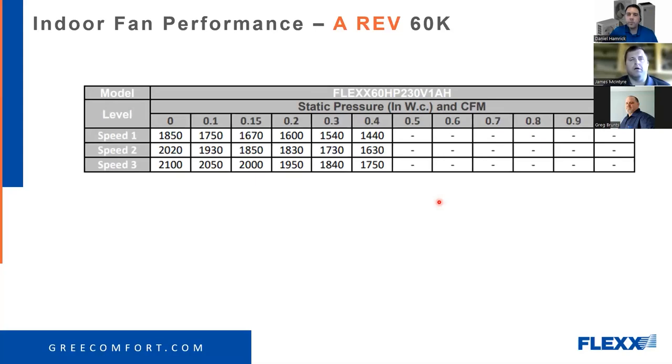Notice the blank entries — if you're at 0.5 inches or higher on the A-revision, you're out of the unit's rated capability, which means your CFM will be lower than what's on the chart. The motor isn't going to shut down immediately at that point, but if static gets significantly higher, it will. No manufacturer yet has built in an interface to shut down the outdoor unit when static pressure is too high, but if you're at 0.9 inches or so, you can absolutely expect the blower to shut down.